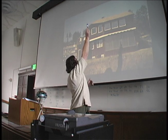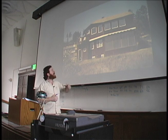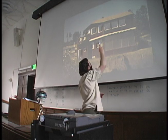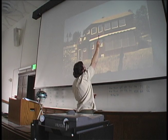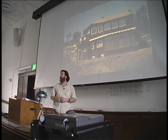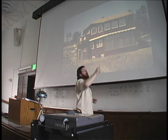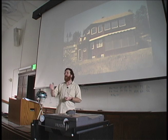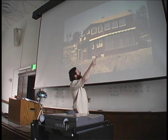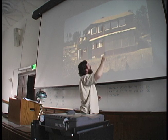This is his overhang — this picture was taken in October, so he's starting to get sun onto the whole wall. This little box up here was sized perfectly for the master bedroom: we had our 150 pounds of masonry for each square foot of south-facing glass. The other side of the wall was oversized for the master bathroom, but I didn't want to stop the concrete two feet from the end of the building because it's holding up the second floor system. So we vented the air space — this is an unvented Trombe wall on this side and a vented Trombe wall on this side.